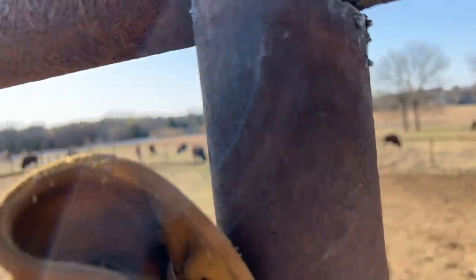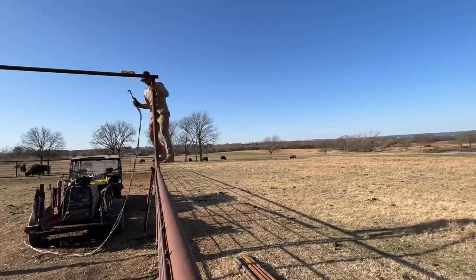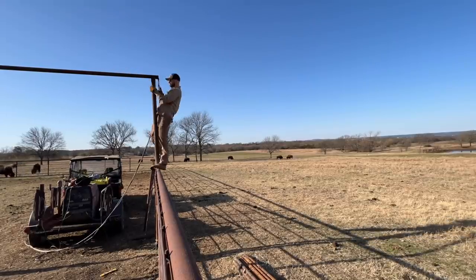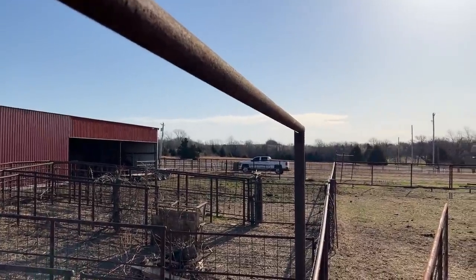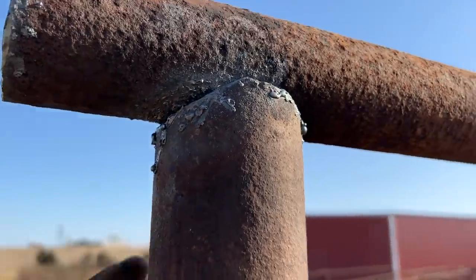I don't know if you guys could tell what I was doing, but what I was slowly doing, just an easy trick whenever you're by yourself. I'm trying to film up here for you, but you can, I made my cut there, made my saddle. You can kind of see the U down there on the first end. I set the pole up here, and then this one was straight, and so I had to saddle it.